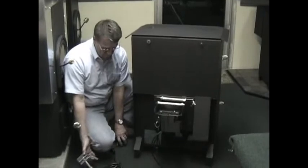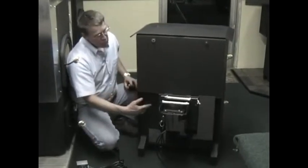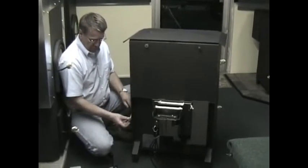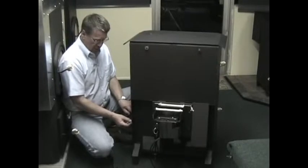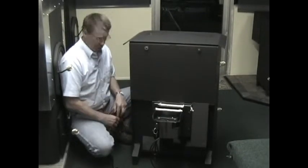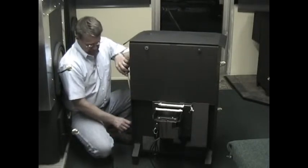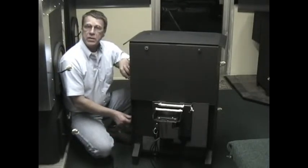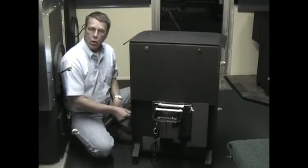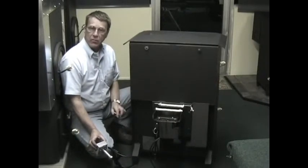On a Pocono or a Hi-Fire stove, you want to come on either side of the stove. Since you have a dual blower system, you have no room on the back. Measure from the back of the stove toward the front 4 inches, and roughly about 13 to 14 inches up — that's where you want to locate your hole to put your switch.